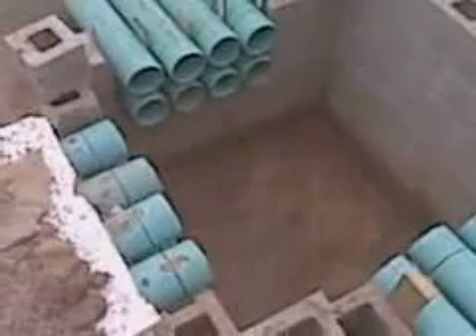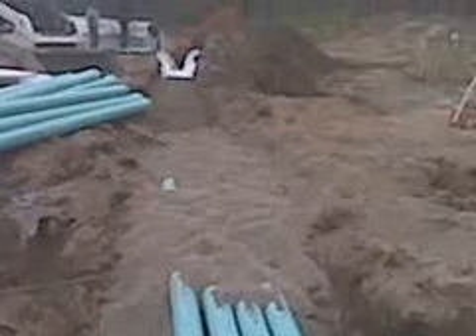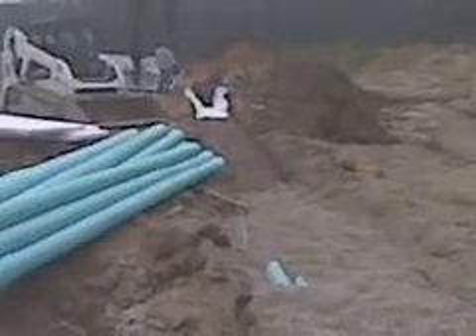Down here is another chamber with the tubes going outside of the home, eventually connecting to the upper and lower tubes that come out of the house through the walls. And then from this chamber, we have eight six-inch pipes that will be running out of the home and underneath the umbrella to a point of gravity flow, daylight exit out in front of the home.